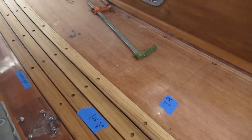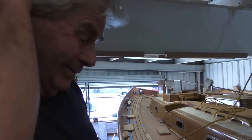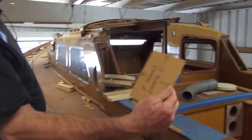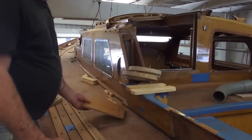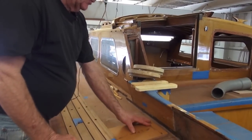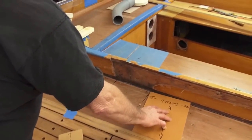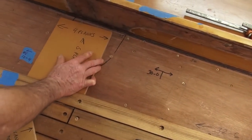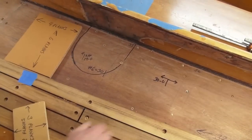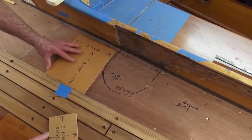See, a lot of this is about layout. I mean, planks, butts, available material, tapers, nibs, and so forth. And this is 2 planks wide, that's 3 planks wide. Okay. So there's 4, and there's 5. And so when you start getting into here, you can see where your planks are gonna terminate. This one's gonna stop actually here, somewhere. See, the winch pads are here. Yes. So we can put butts under here. You like that? You like it? I love it. Yes. Because they're being held down.